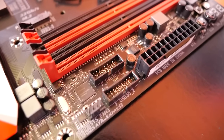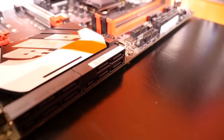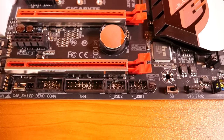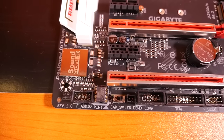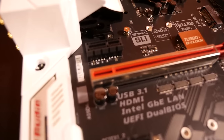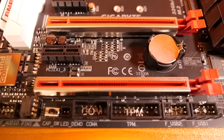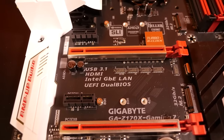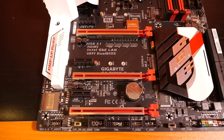The connectivity is amazing. We have two front panel USB 3 headers, lots of fan headers, three SATA Express and eight SATA ports. The usual front panel USB 2 and audio. Removable and upgradeable op amp with extra gain settings you can adjust on the motherboard — I love this feature. The stainless steel covers on the PCI Express slots just make them so much stronger and improve the aesthetics. For a water cooled build where a lot of extra weight goes onto the slots, this is a great feature. Two M.2 slots as well, which is something I would definitely want on any board I choose for my own build.